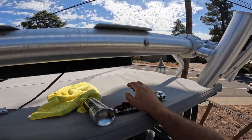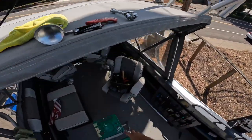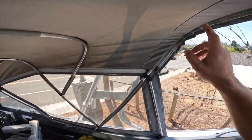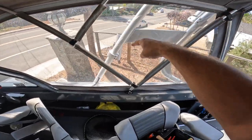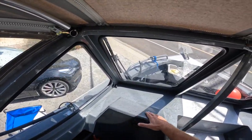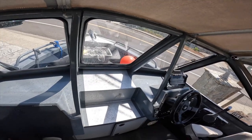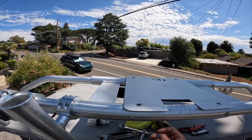Today's plan is to install the Halo radar, drill a hole in the tower tube, and feed the wire all the way down — following the lighting wire path into the foot of the tower and out here. The other piece I want to finish today is mounting the FS9 right here, drilling holes, and wiring it up to the electrical panel down there.